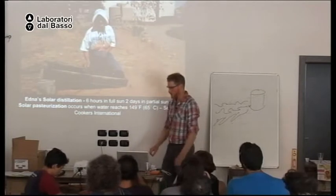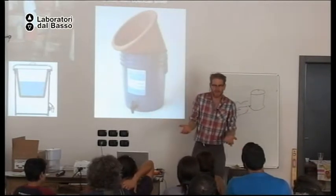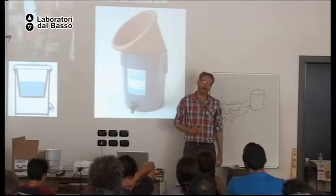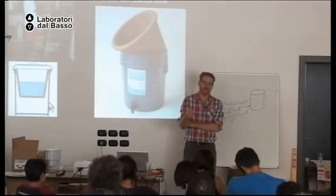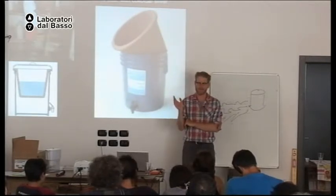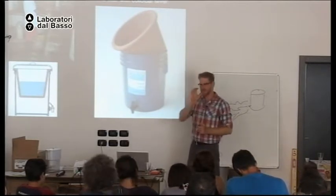So I tested the water coming out of my cisterns before I got a filter. And I recommend you do that. Most companies that make filters say, buy this filter. But maybe you don't need it. First, see what is in the water. Maybe it's fine. So I tested my water an hour after the first rain after a long dry spell. I tested the water at the time I most likely had the worst quality water. And there was no problem because I follow these water harvesting cistern principles. There's no light, there's no insects, there's no critters getting inside, everything I talked about at the beginning of the talk. So I can just drink it straight.